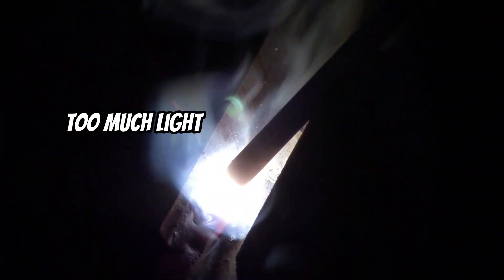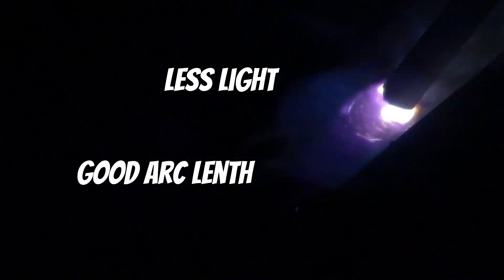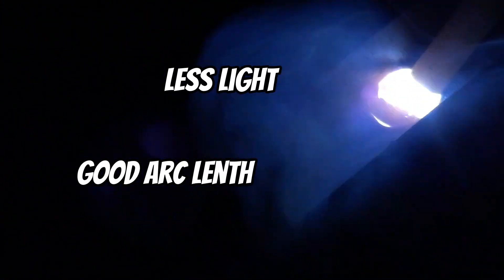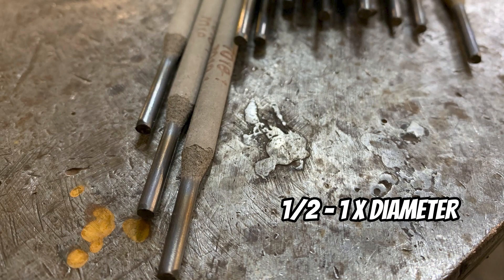Turn down the lights — no, not your lights in your garage, not your lights in your shop. If you're welding along and your plate is lit right up and you've got everything to see, that tells me that your arc length is too long. You need to tighten that arc length. You need to get closer to that plate. Go back to your basics. Look at how long that arc length should be for the electrode type that you're using. Generally speaking, we want to be between half and one times the diameter of the electrode. If you're welding with a 1/8" rod, you want to be 1/8" from that plate.